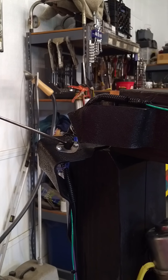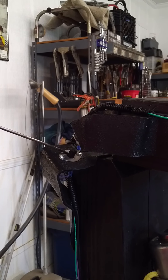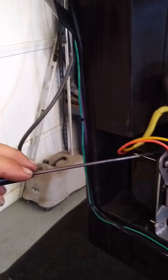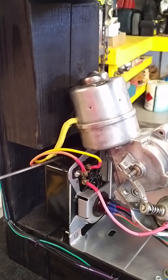This piece here is your opening limit switch — it's a ground fault switch which actually works off a plunger. Moving down here, this is your relay assembly. This is the brains of the whole operation that controls all the sequential movements of the trunk lid.